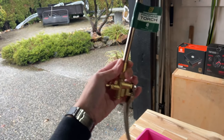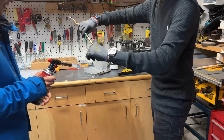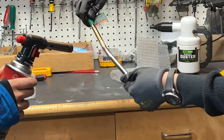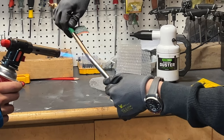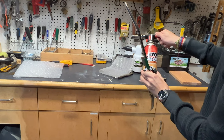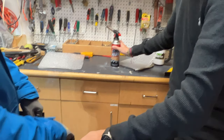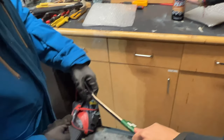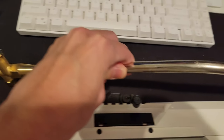With those removed, you'll need to bend the tubing so it fits inside the shell. I used a vise to help with this process. It's critical that you're cognizant of the amount of pressure you apply because the metal is soft and will tear if you overextend the bend. I recommend using heat to assist — I heated the bend point using a butane torch and used a crescent wrench as a lever to bend the tube in small increments. The bend isn't perfect, and doesn't need to be, because it's concealed in the shell.